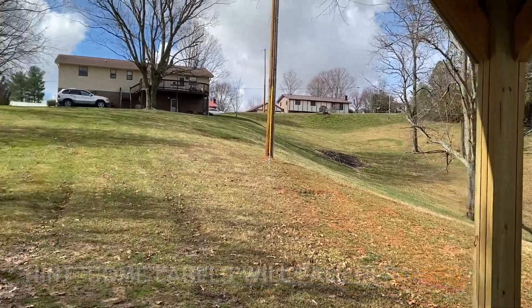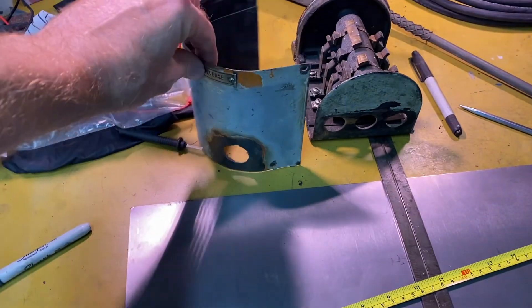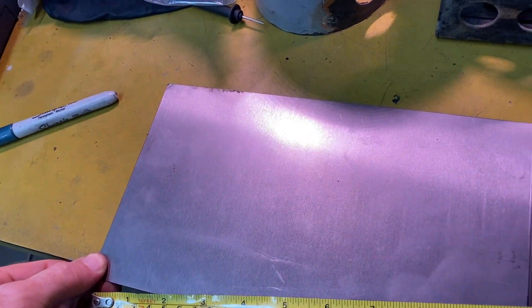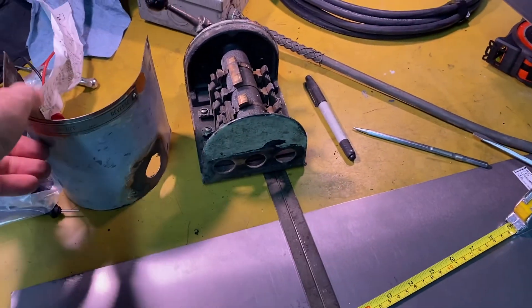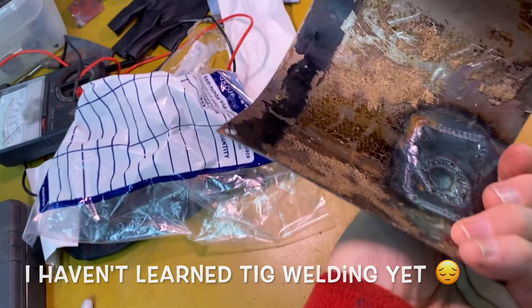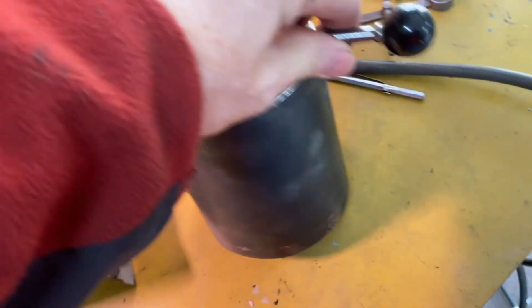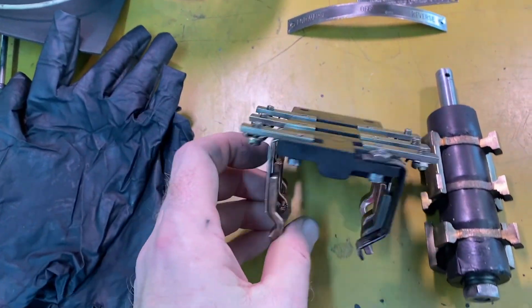I've decided to try to remake this part. I measured the thickness — it's about 37 thousandths, which I think is 20 gauge, maybe 22. My local Lowe's had 22 gauge, which is a little thinner at about 25 thousandths. I got my welding teacher to TIG weld a thin piece of metal as a patch, but it doesn't look as nice and smooth as I wanted. Using sheet metal I was able to curve it into a pretty good shape — not perfect, but I think it'll work.